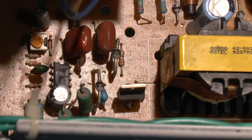And the key thing you're looking for, you don't want things to be completely open. So say a resistor was showing open circuit, clearly it's failed. Or something was showing a short circuit. Again, clearly that's not right either. None of these show any of those things. So they're all having fairly credible values on those.